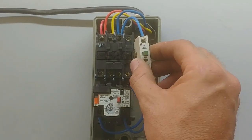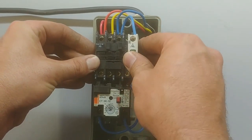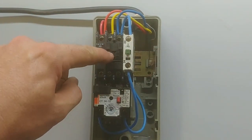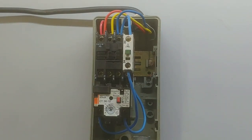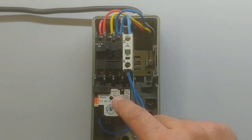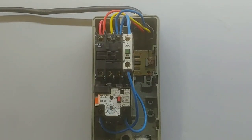Now this normally open switch actually has a little trick — it slides onto the contactor and engages with it. You see if I push this, the little green button moves as well, so then you don't need the holding wire. If you hit the button, it stays in. Just make sure if yours has that — it's a neat little feature to save some time. You can see the green button: as I push it, it stays in place where the contactor holds it. That's how to connect the Direct Online Starter. Thanks for watching, see you again.